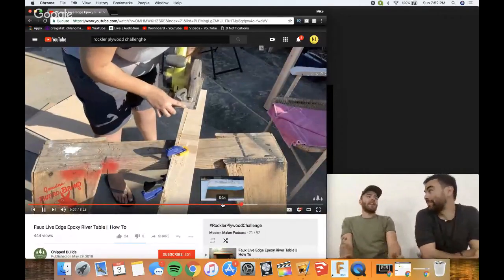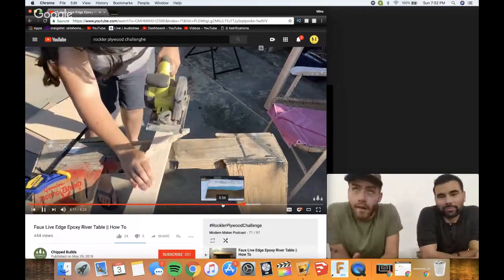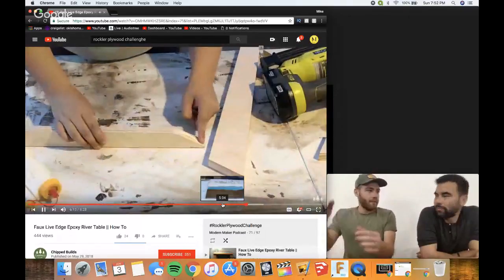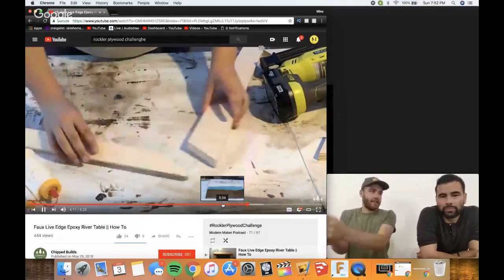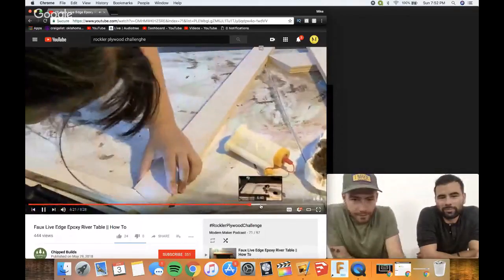You don't need to have one really long side and one really short side. Just make them both useful. Yeah. Also, I hate how floppy they are. So I just need to cut them the same angle. If you hold the circular saw out, it stays straight. And then I glued and nailed these 2 pieces together to form a set of legs.